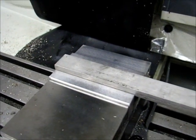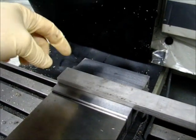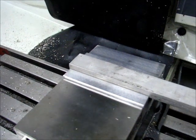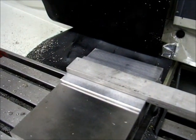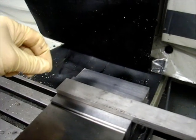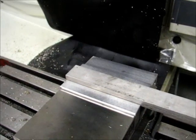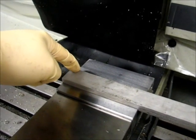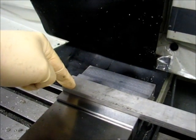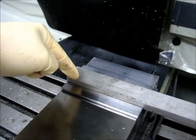The next thing I'm going to test is the finished cut — how deep that needs to be. From what I've found so far, my passes with the cutter at the nominal dimension leave about half a thou of extra material. On this profile I'll cut half a thou extra, and then I'm going to cut eight tenths of a thousandth extra on this one.